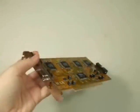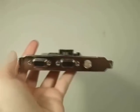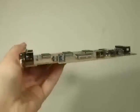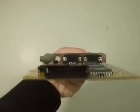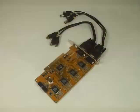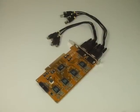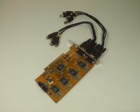One of the coolest features of this DVR card is that it has motion detect recording. That means it records only action and not hours of empty footage. Using this feature saves precious memory space and increases your recording length from a few weeks to over a month, depending on the size of your hard drive. It has enhanced MPEG-4 compression technology and can be stacked so you can use up to 32 channels.